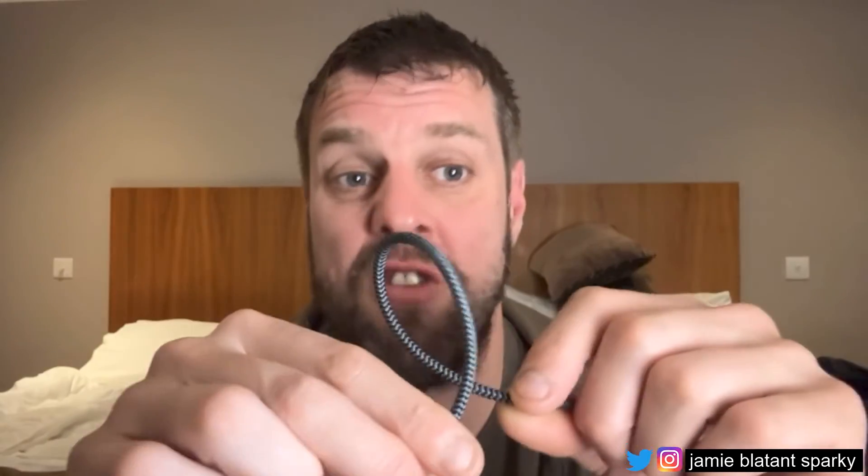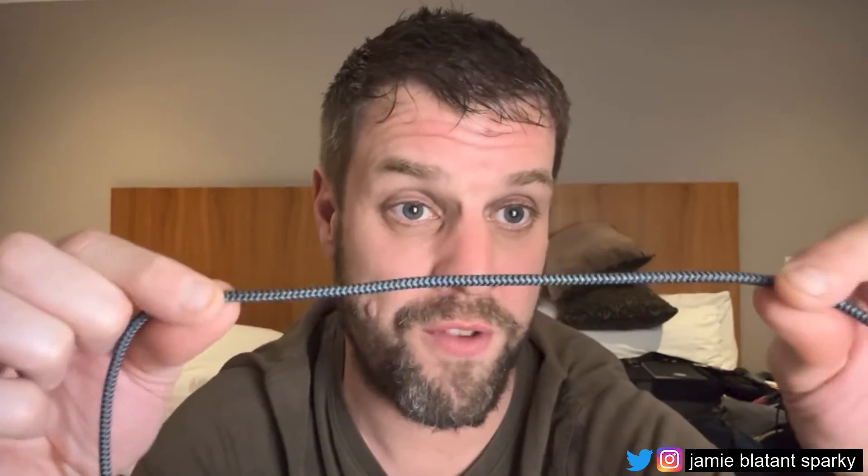When you're manipulating cable, be aware it's twisted. When you get the bends in, if you let it relax it'll move much easier. Don't start trying to kick it around or drag bends in that don't want to go in with ratchet straps, because you'll split your cable and bird nest it. Just let it relax - let the natural tension release. Remember, a cable just wants to be wrapped around a drum - that's how it likes to live. It doesn't mind going straight but it doesn't like lots of bends. Some people tell me I'm mad, but I've never bird nested a cable where the armor splits open. This is how I was taught by one of my old bosses 20 years ago, and it all works.